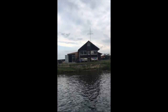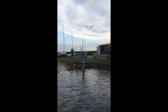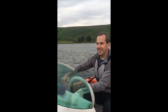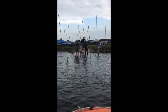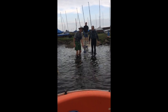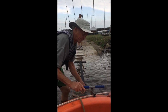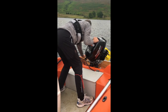At the end of the race, if you attract the attention of people on shore — if they're not already there waiting for you — they'll bring the trolley down to collect you. Then you're going to drive the boat onto the waiting trolley, just as if you're driving up the slipway. Keep your speed down. And then cut the engine. If you're on the trolley, bring the engine fully up.